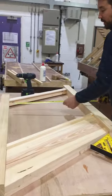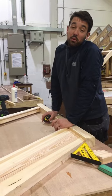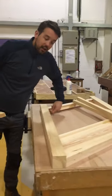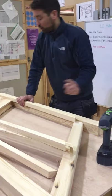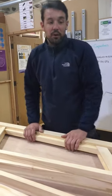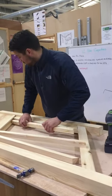For my spindles, I've measured the gap in between — 590mm. The maximum space in between a spindle is 100mm to comply with building regs. So I know that I'm going to need about 5 spindles, and I've cut 5 spindles. What I've done here is there's a rebate here and here — that's 11mm. I've come back 11mm and put the spindle on top and marked where the short and longer mitre is to produce that. Again, that's 37 degrees. It's really important that these are tight fitting — you don't want to be able to move them up and down because that will affect the quality of your finish and it makes it hard to fit them.